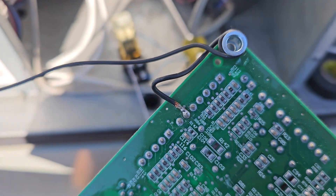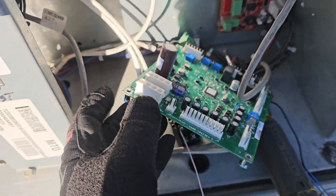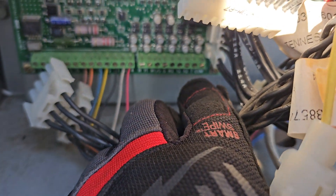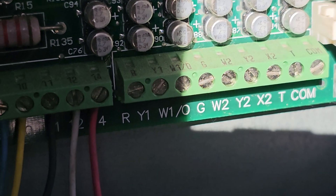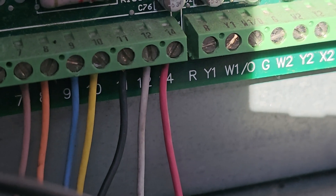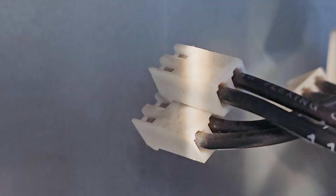I'm going to put this back into the unit right now. You can see where I got my wire soldered on — a little bit out of the ordinary. I'm going to hook this relay up. I got common on that RTM board. There's C and 24 volts on the RTM board right over there in the corner. You see the RTM board — you've got R, Y1, you've got all the regular thermostat terminals there. C right here is COM — I'll double-check it — but that's where I'm going to put my other wire.